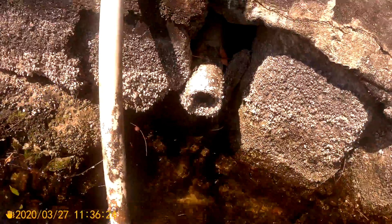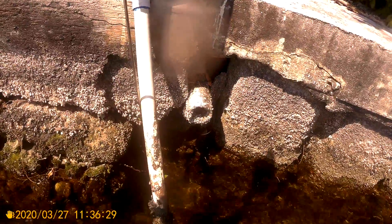There is also a pipe here coming between the two properties which is completely open. This property has a sheet piling wall but the neighbor's side is open completely, so every time it rains, erosion happens from areas like that. You can see it right down here — it hasn't been raining lately so there's not a lot of it, but there is definitely some fresh sediment.